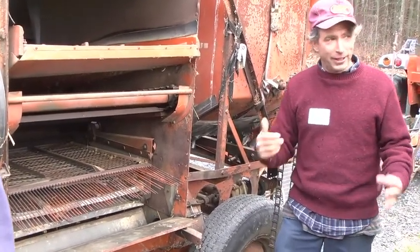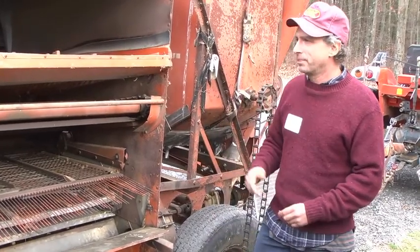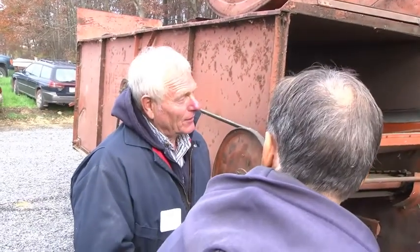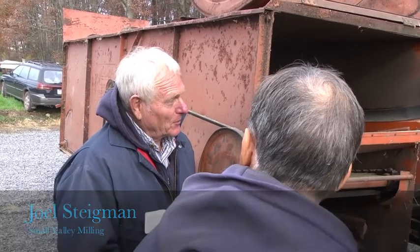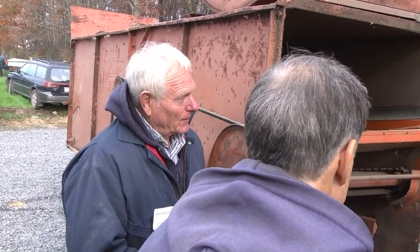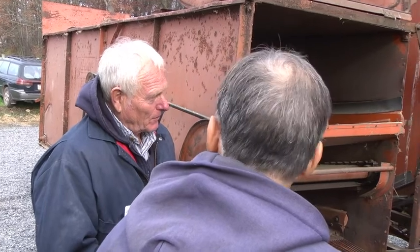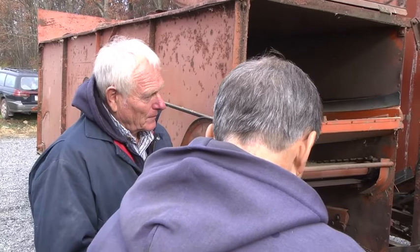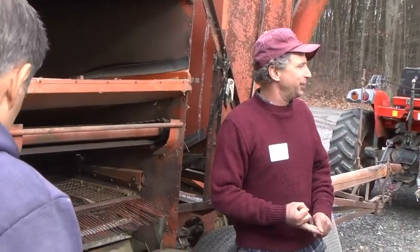Right. And you could do that, but you've got to slow down, or you're going to plug something up. Believe me. Now, what do you think about, like, for wheat and oats and stuff like that? You run it slow, but like we tell our guys when we're doing spelt, run around 1,000 RPMs to run it tight, and it'll dehull. Yeah, and it depends what you're trying to do and how hard the crop is to thresh. The adjustments on this are going to change. They change from early afternoon to late afternoon as the crop dries. You've got to constantly be checking what you're doing.